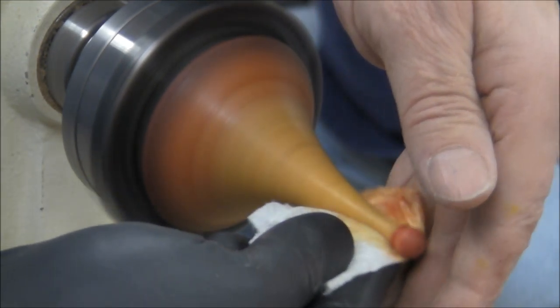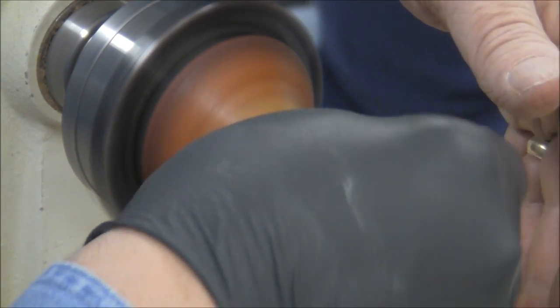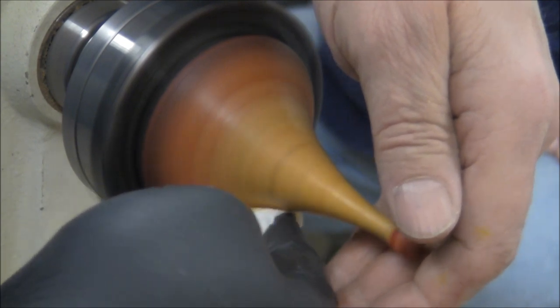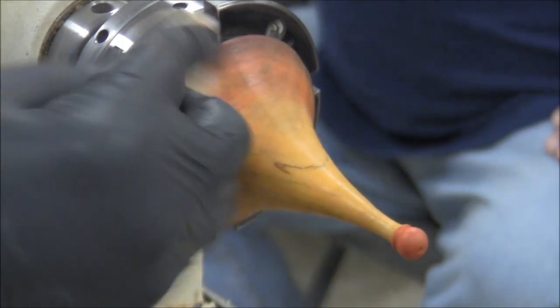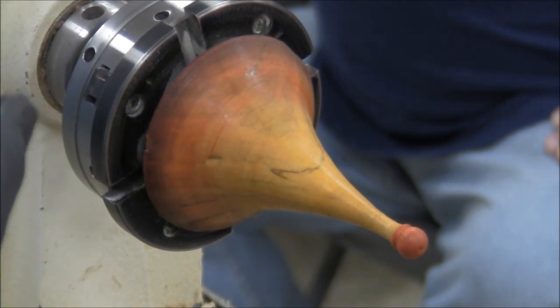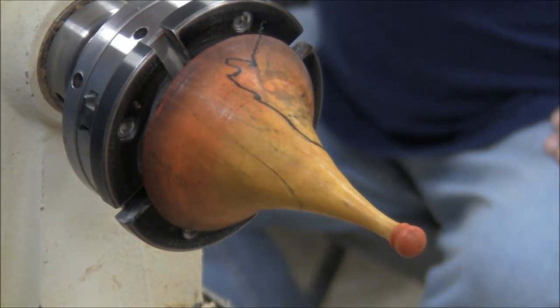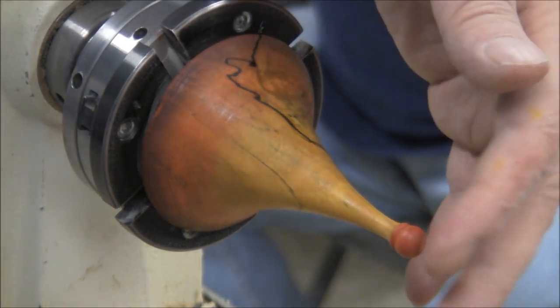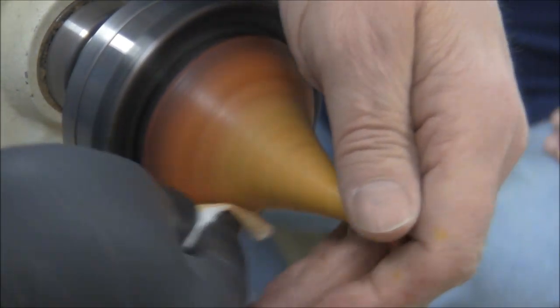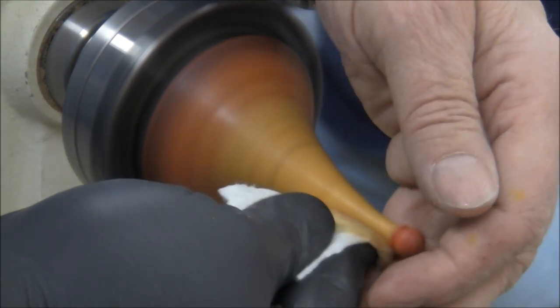This is going to come up a satin finish due to the 220 sanding instead of 400 or 600. So do you usually take them to 600? Usually, I do. Sometimes I'll go further. At one time I tried using the micromesh. I took the wood all the way through all the steps, and then I compared it to a piece that I took to 400 and put a friction finish on it. I couldn't tell the difference. So for plastics, sure, take all the way with the micromesh. Wood, no. If you're going to use something like a CA finish that dries hard and has to be sanded down, it'll work there. But for something like this, it's a waste of time and effort.